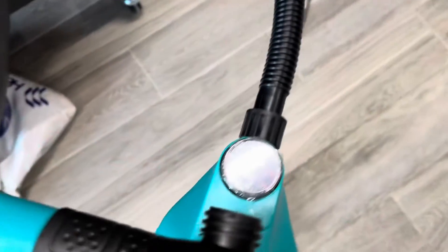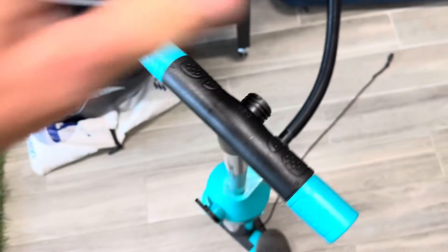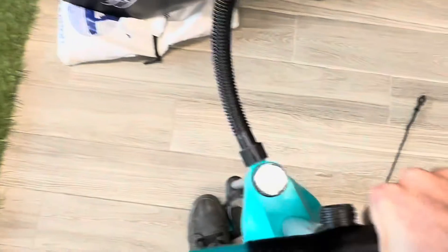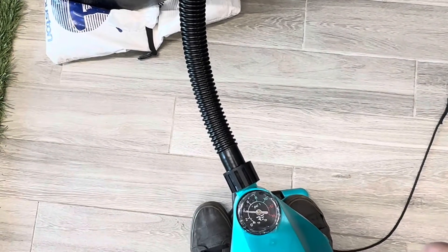We have our pump with the pressure gauge. It's a double-action pump in single-action mode so I can pump it up and slowly push it down. I put some tape on the cone attachment and stick it inside that hole, then pump down and put a little bit of pressure in — I like to keep it around 4 psi. It's leaking; I can hear it. You can see it right there — see that bubbling out? Step one complete. We found one of the holes; I'll pump it up again after I fix the first big hole to find the other two.